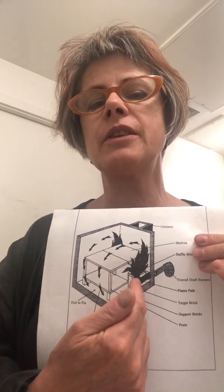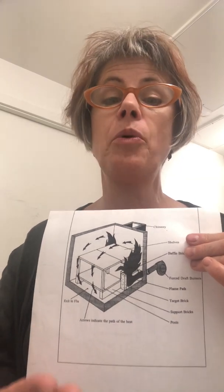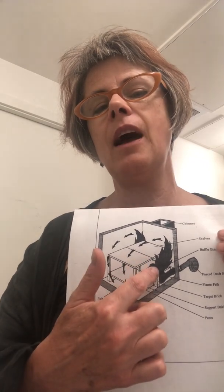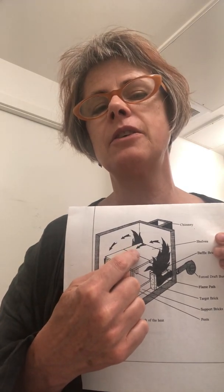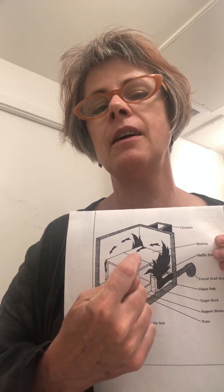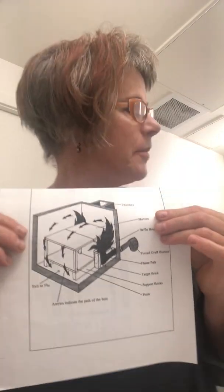To review: next to the target brick, the flame hits a series of about three bricks that make a little rectangular box inside the kiln — that's what we call the bag wall. They are very important bricks and need to stay there. At the bottom of the kiln we have the exact same setup: one shelf in front and one shelf behind. The center brick is shared between the front and back shelf, and the back shelf has a brick for furniture support in each back corner.